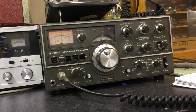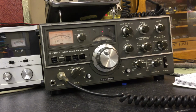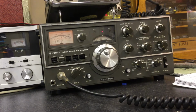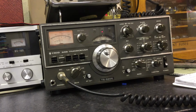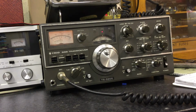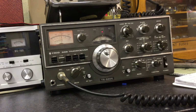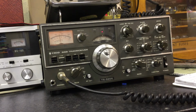And of course, down this low, you can be very sloppy and forgiving with your construction and your design. You can get away with blue murder. Whereas as you go higher in frequency, your wiring has to get a lot tighter, and your design layout has to be obviously a lot tighter as well. And I'm inherently lazy, hence the 90-foot long wire, a wire that's been up there for donkey's years, long before I was even licensed. I got my licence 4 years ago and just got bunged on the end of it, and then a coax into the loft. So yeah, I'm probably a bit more haphazard and slapdash with the way I do things.